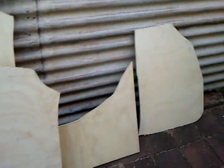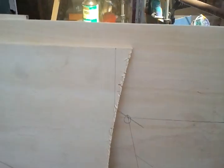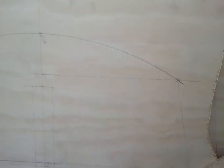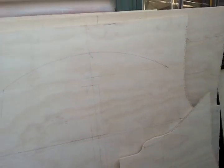Behind there is bulkhead 5, and down the end here is bulkhead 1 — that's the front of the boat. From here, once all of these bits are cut out roughly — and you can see hopefully how rough the edge is; a little bit of scale by my finger there, it really is very rough indeed — I swap over to a metal cutting blade with fine teeth on the jigsaw and I mount the jigsaw on my trusty Triton workbench, and I just use it like a sewing machine and go around and cut out right up to the line. That's where I'm at today, and hopefully by the end of today I'll have cut out all or most of these pieces.